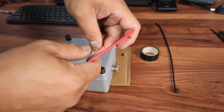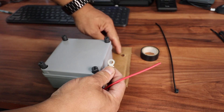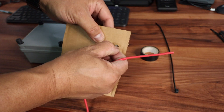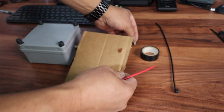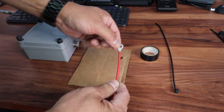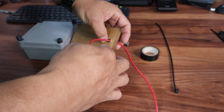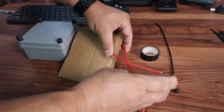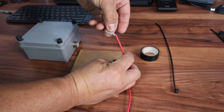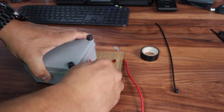I have a ring terminal — I'm not sure of the exact dimension, but I have a drill bit big enough to create a hole in the back plate where it passes through. So this is the plan: imagine the ring terminal is connected. I'm going to loop through the back plate with enough slack, and this portion where the ring terminal is connected and soldered is going to go to the 4-to-1 balun — just like that.